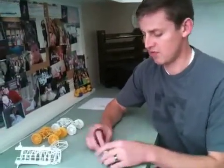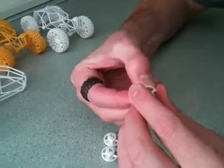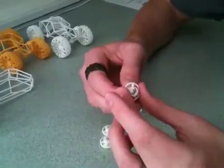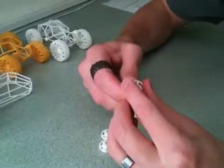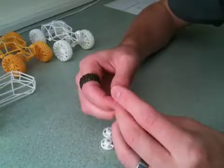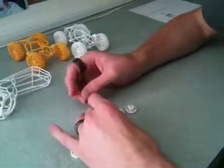At 0.3 millimeters right here, this one has absolutely no space in between — it is just stuck together. If you're making parts for yourself and not planning on selling them to someone else, you might be able to get away with a clearance this small, knowing that you yourself might break the part. I got it to spin a little bit, but by doing so I bent the material. I got it to somewhat turn, so it is possible, but not recommended.